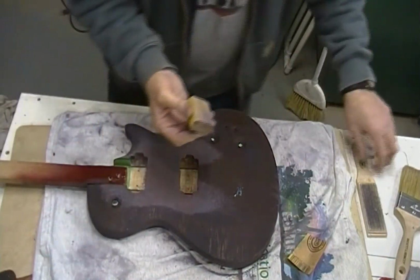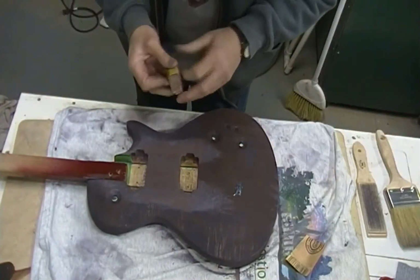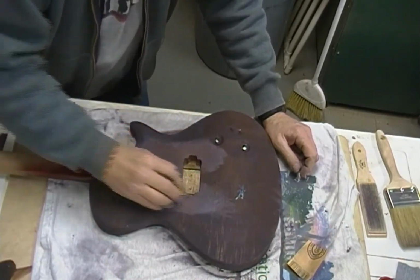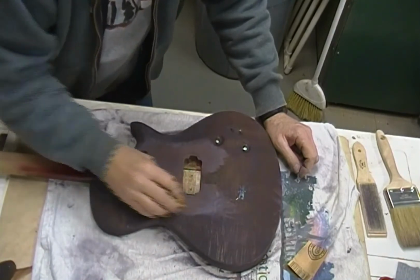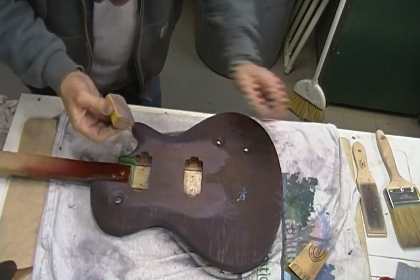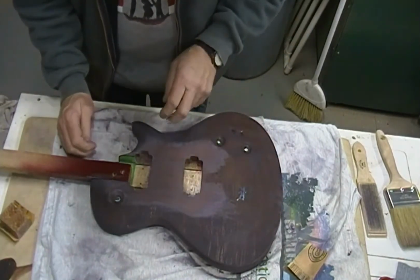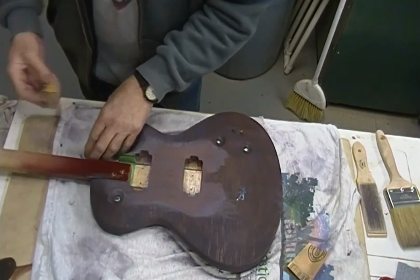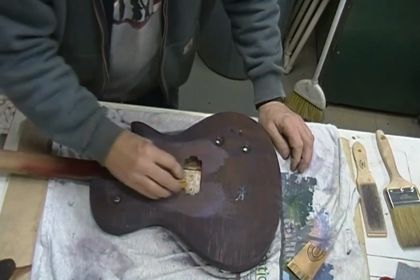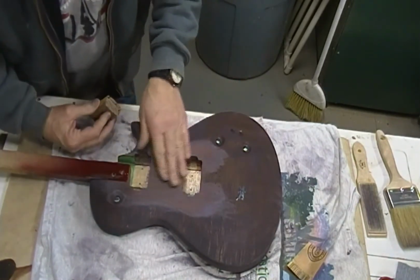And as I usually end up telling you, I'm not gonna bore you and sand this entire guitar. I just want you to see how quickly this is doing the job. So I mentioned in the last segment that if this sanded off nicely and produced a pretty good fill by leaving it on a little extra heavy like it is here, that I would definitely be going this route. I would just start from the very beginning and leave it on really heavy. But until I reshoot this, I won't really be able to tell how much really stayed in the pores.